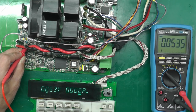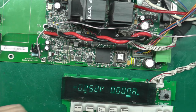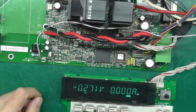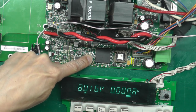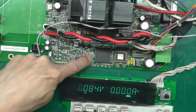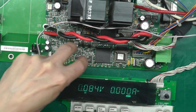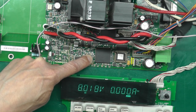I think I've identified a problem with the control circuit. Looking at the output of the main constant voltage op amp and the constant current op amp, the signals are not stable — up and down like a yo-yo. Following back the CV signal through the op amp that provides gain, you've got the main CV ref signal from the DAC, and similarly the CC ref from the same DAC. I put my multimeter on the outputs and found that pressing down on the DAC area causes it to immediately jump up to 8 volts in constant voltage control; releasing it, it drops away again.